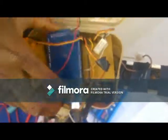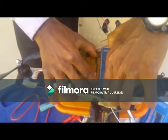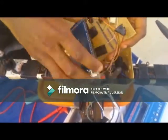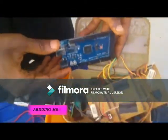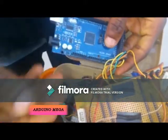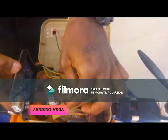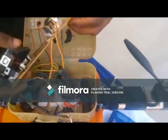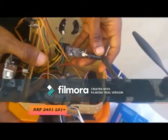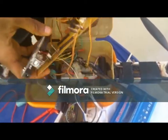This is Arduino Mega. The Arduino Mega functions like the one on the transmitter part — it handles the programming and collects data transmitted from the transmitter. This is the cable for the fan that powers the cooling fan. This is also our NRF 24L01 — this is the receiver. It collects data signals from the transmitter and sends them to the Arduino board. The Arduino board then tells the ESC what to do.